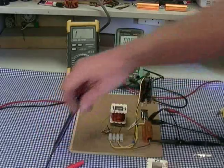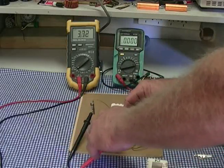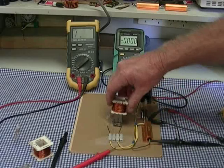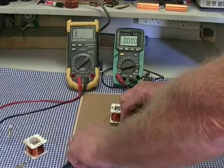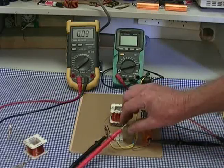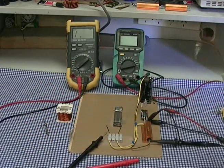Back to our coils — we have our inductance meter here. Coil number one, which produces a magnetic field, must have inductance: it measures 3.4 millihenrys when on the core. Coil number two, which does not produce a magnetic field, should have no inductance — and it measures 0.09 millihenrys. Not quite perfect zero, but close enough to do the job for what we're going to show here.